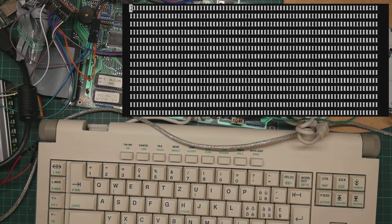So given that, this basically isn't working. We just don't seem to have enough time in the V-blank interval to update the entire screen. We're gonna have to be a bit cleverer and update the screen over multiple V-blank cycles. And if we're going to do that, then there's not really much point using the DMA stuff, which I can't make work anyway. So let's just go back to using the LDIR stuff.